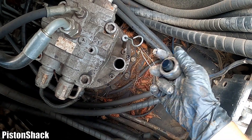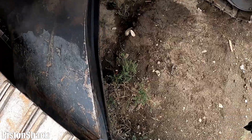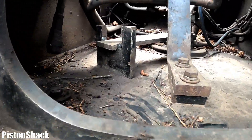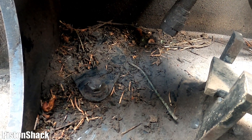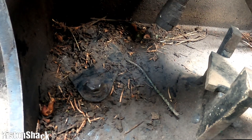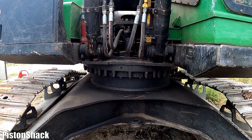That's where you fill the gear oil and keep your swing motor reduction part lubricated. Here we go — here's our inspection lid on the side. We'll pop that cover off and see if we have any milkshake. Here at the slewing tub, it will be interesting to see what we'll find. Let's get started.